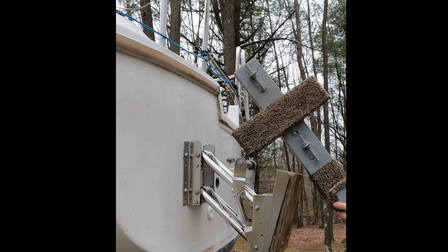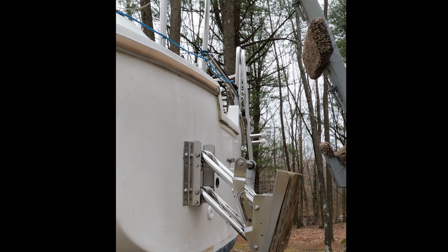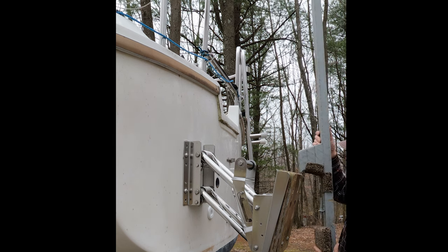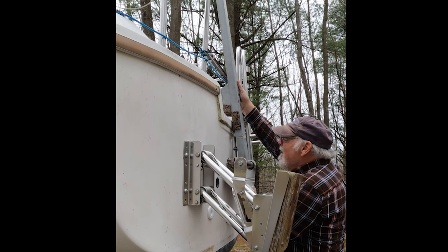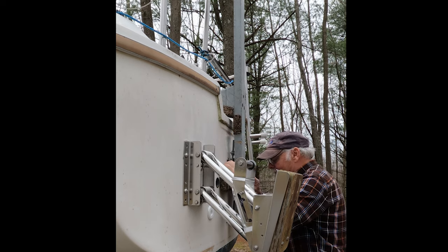Before I launched this Catalina 22 for the very first time, I built a stern crutch to hold and guide the mast before raising. My mast spans the hull from the stern pulpit to the bow pulpit, so I do not need a crutch to haul it, so an adjustable crutch with a height adjustment was not necessary. Building one out of wood to get started seemed like the easiest and the most economical way to start. I bungeed this wooden crutch to the trailer.